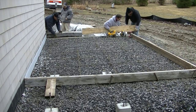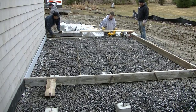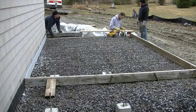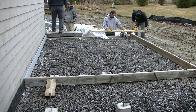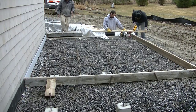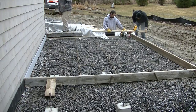So what we're doing is we measure it out from the building 10 feet, to set that form on the right — the 16 foot form — so we got that parallel with the building. And then we put a 10 foot form right here, the one that's right in front of you. And did a 3, 4, 5 off that to get it square. There's a frost wall right there in front of me, and that frost wall comes right off 90 degrees from the building, so we can measure off that too to make sure all our forms are square.